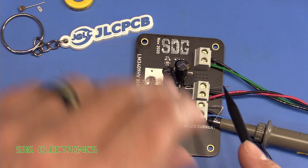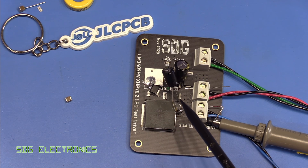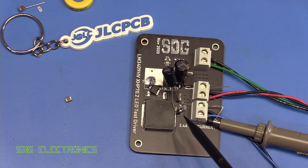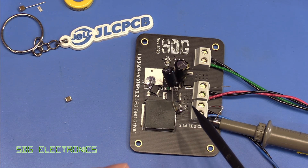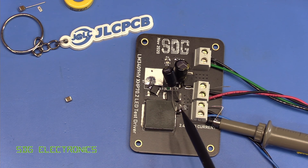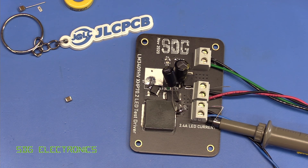There was a comment about the layout possibly having an effect. This layout is pretty much identical to that in the datasheet, with a minor change — the final PCB has much larger planes and polygons between all of the pads, so that one should behave even better in terms of performance. But that is not what was causing the effect they were hearing. Hopefully you found the video interesting and learned something. When it comes to your own designs, consider whether it's a sensible idea to use these large ceramic capacitors on your PCB. Thanks for the comments and until next time, thanks for watching.